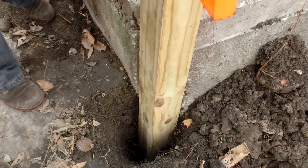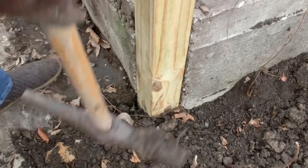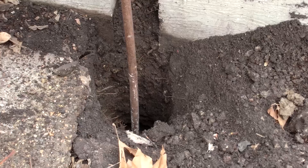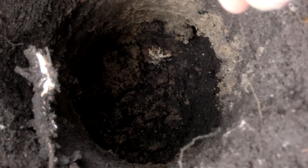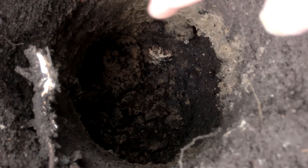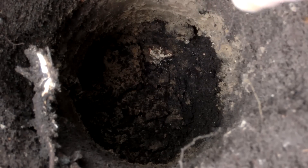Let's pull it back up and put the brick underneath it. Now let's start on this other one. We have the hole down to about 2 feet or so, and you can see there's a piece of concrete right there. We're actually cutting back into some dirt — we went from dirt to clay to dirt, and it looks like we should hit clay underneath that. We're actually hitting the natural floor of this side of the hill that we're on.